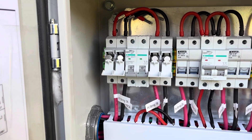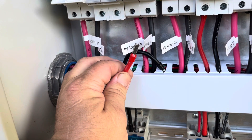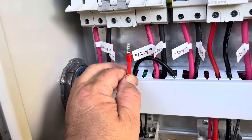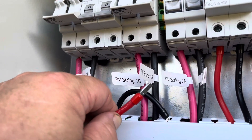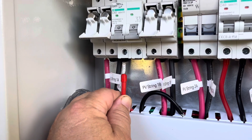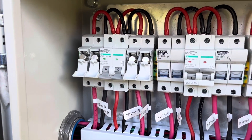I need both hands to put these wires back in. As you can see on some of these wires, particularly these right here, I'm using a ferrule. This is number 10 hookup wire - very flexible wire with thin, numerous strands. I put the ferrule on there to protect the wire. If you have standard wire like THHN or PV wire, you really don't need it, but on this very flexible hookup wire I use these little ferrules.